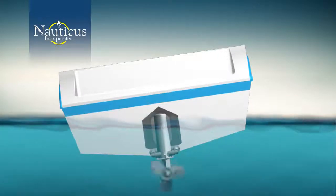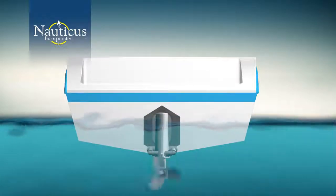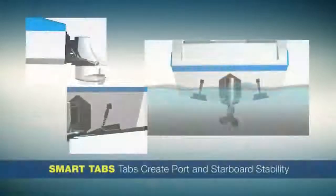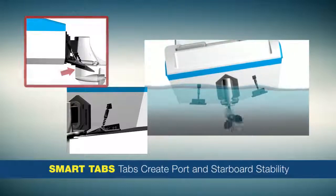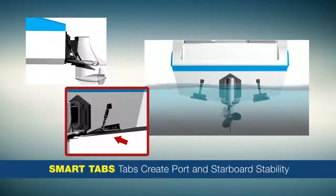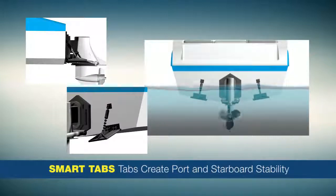If you're familiar with riding a motorcycle, you know that in order to turn corners — especially at high speeds — the bike will lean in the direction of the turn. The same can happen when turning your boat to port or starboard. As you can see with Smart Tabs installed, the left tab deploys slightly, anchoring the turn to port, and the right tab remains horizontal. The same is true in a starboard turn: the right tab deploys and the left remains horizontal. Smart Tabs respond to the boat's condition to maintain a smooth and level ride.